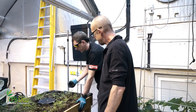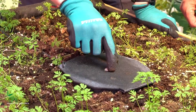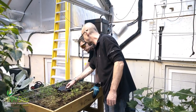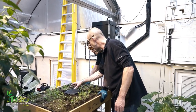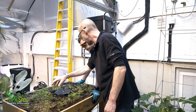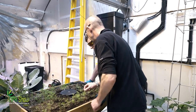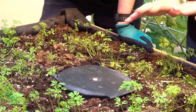There was one other thing I forgot to mention: I've noticed there are these little spirit bubbles on things. What's that all about? It's just to allow the customer, when they use the aquavalve cover over the top of the aquavalve, or use the aquabox, to know that they've got it level. They know that the aquavalve and the aquavalve cover sitting in the tray is level, because the spirit level tells you, and the same on the aquabox spider. It's very simple, just level it off by pressing it in the corner, and then you know that you've got equal distribution of water entering that box and spreading out as it goes into the bed.